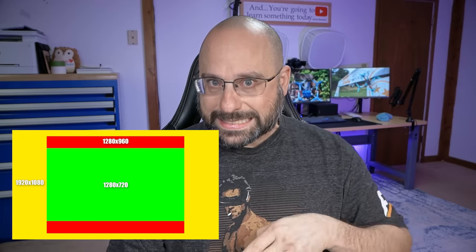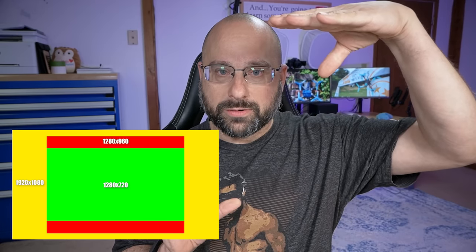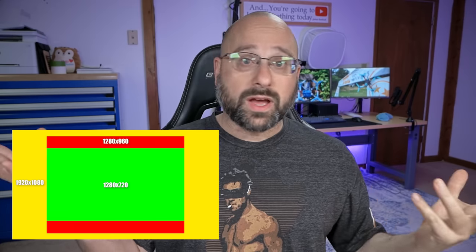It's 1280 by 960. That's just a 4:3 aspect ratio. But if you just chop the top and the bottom off, you've got a 720p screen. Except there's a little bit of a quirk. These HDO2 goggles can only display a 4:3 aspect ratio feed from the HDMI input, which means that if you send them a 720p signal from this VRX, they will stretch it vertically, and you'll see a little bit of distortion because you no longer have a one-to-one pixel mapping from the video feed that's coming in versus what's being displayed. Is this a deal breaker? Well, the stretching kind of might be a deal breaker for some people. Theoretically, Walksnail could implement firmware that letterboxes the image.